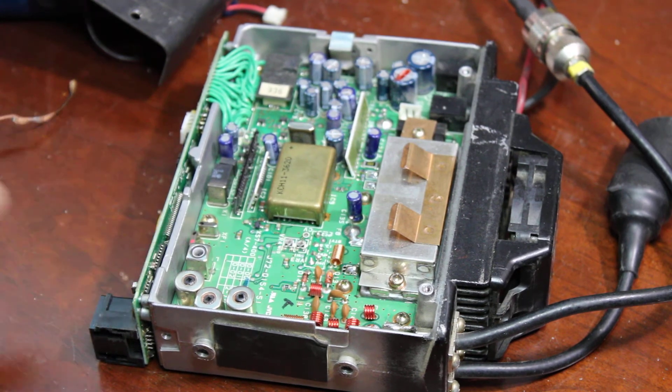I repaired it with just a wire — run a wire straight through the board to fill it. It's a via hole that goes through the board; just put a wire in there and clear all the capacitor residue off, then replace the capacitor. The electrolytic material came out of the surface-mount capacitor and ate out the via from one side of the board to the next. So look for that.